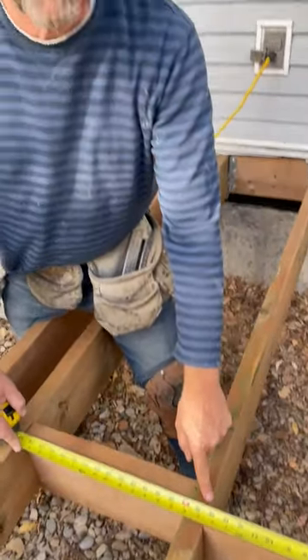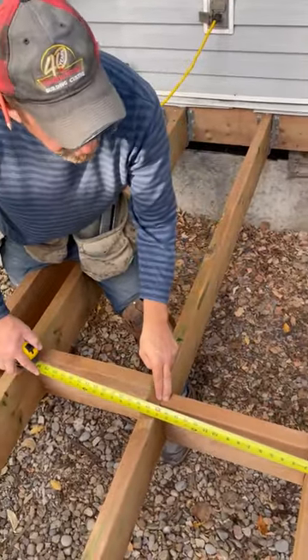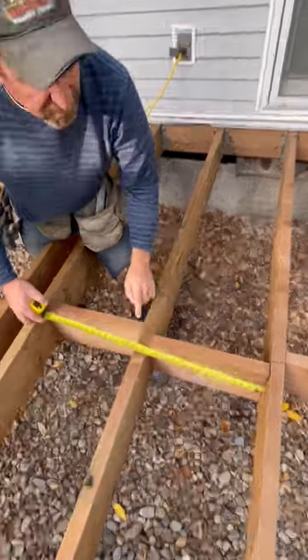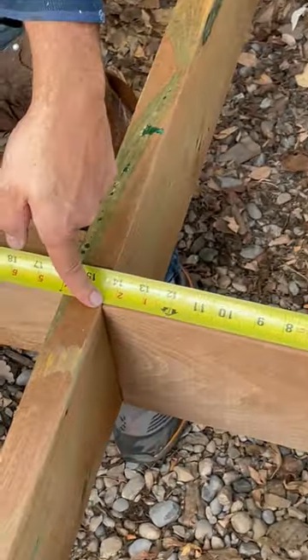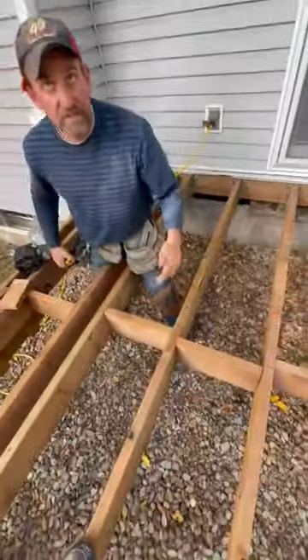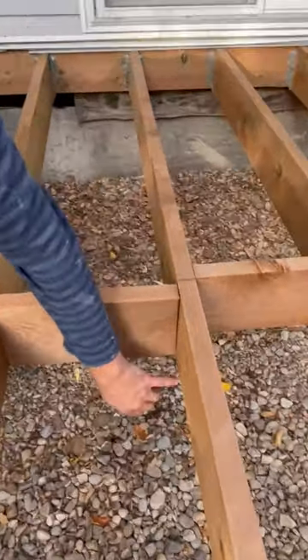7 out of 10, getting perfection every time. In theory, my joists are 16 on center, so this lateral blocking in between should be 14 and a half inches. But we intentionally cut it 14 and 3/8 inches, and that is to account for the imperfections that are going to happen with your joists.